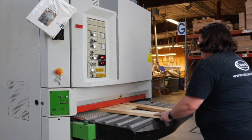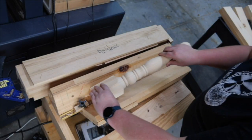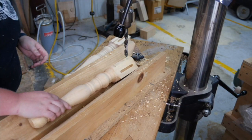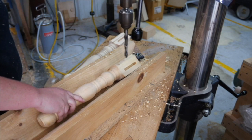The top, bottom, and sides of each apron board are sanded to 150 grit, which increases the ease of finishing. Next, the table legs are given a chamfer cut to create a flat surface on the inside facing corner of the leg. The mortise joint pocket is cut into the leg, then a hole is drilled into the center of the chamfer.